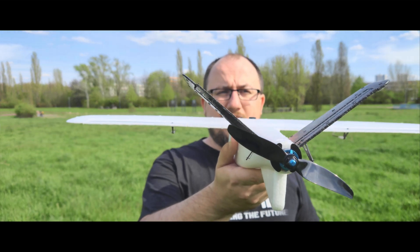This flight setup weighed 246 grams with the lithium-ion battery, so it is possible to fly under the 250g mark — though this was without a flight controller. The V-tail is really flimsy with no carbon reinforcement in the V-tail itself, only in the control surfaces, so it's very flexible. The wings are also not as stiff as on other planes — no fixed carbon spar, just a thin flat carbon strip placed vertically. So this is definitely not a high-speed plane without special reinforcement.